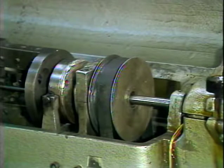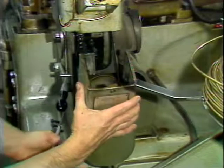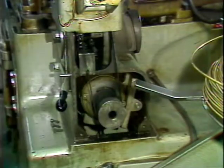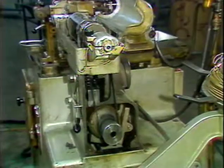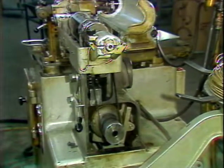This pulley and belt at the rear of the stock straightener rotor, and the pulley and stock straightener motor located behind this cover, provide drive to the straightener rotor. Different size pulleys for both the upper and lower pulley positions are used to change the straightener rotor speed.